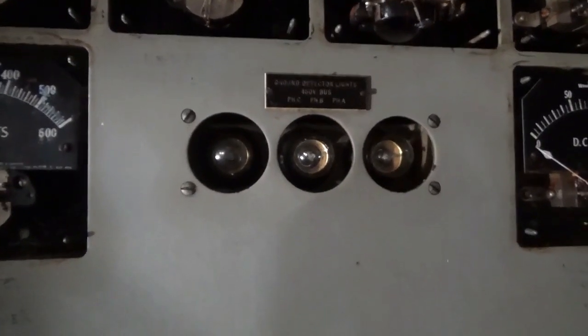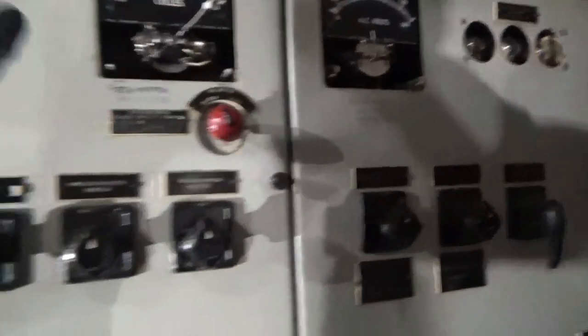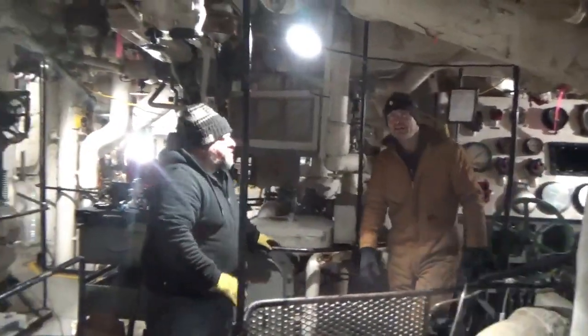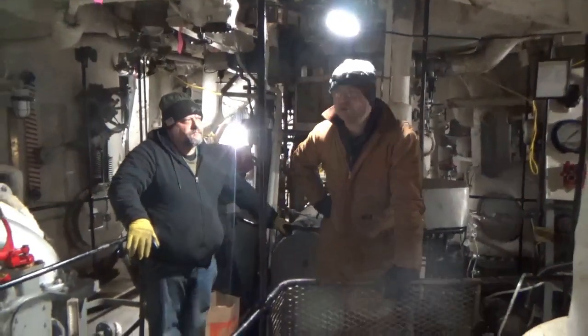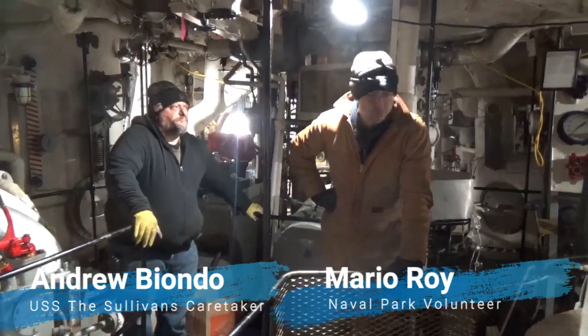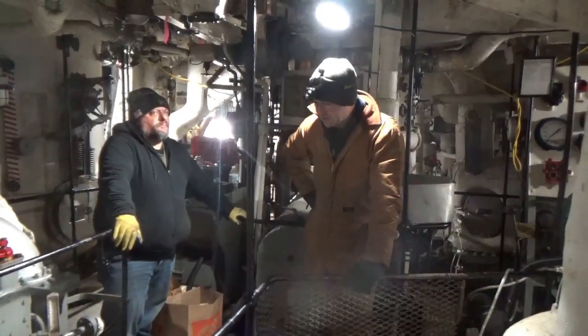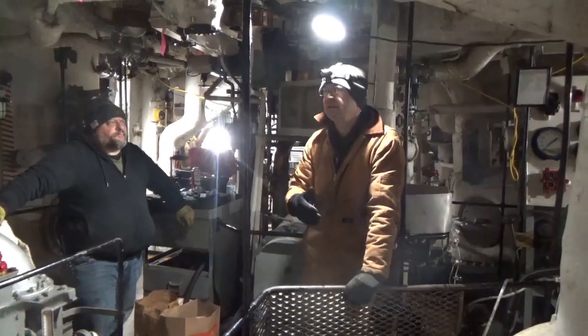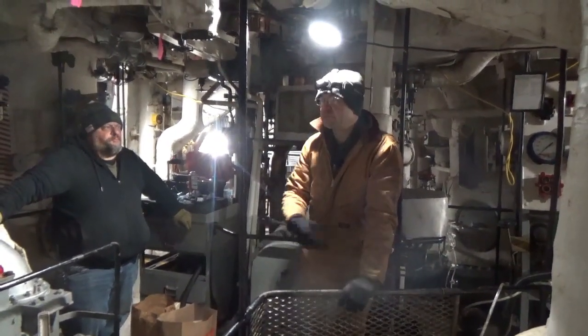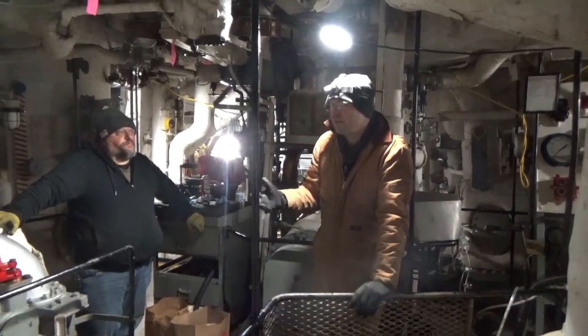So I think he just plugged in the main line from this panel to the shore power. We'll refer to it as temporary shore tie, or temporary fuse disconnect. It continues to provide the 20-amp circuit protection — it's got fuses in place. Right now, if we exceed 20 amps, it'll help protect the board.